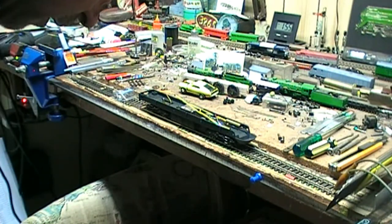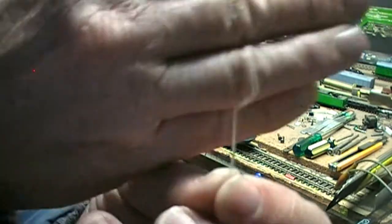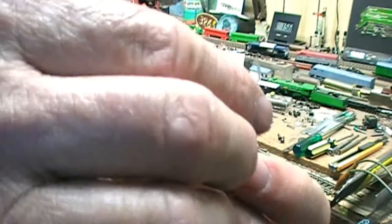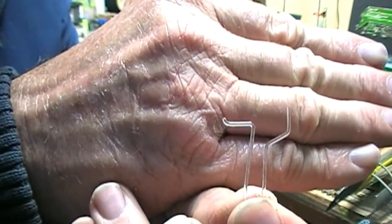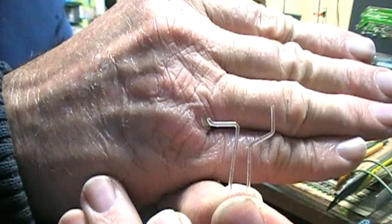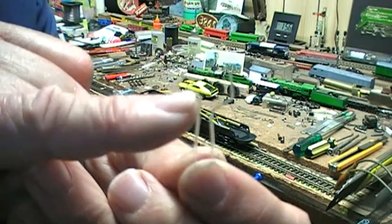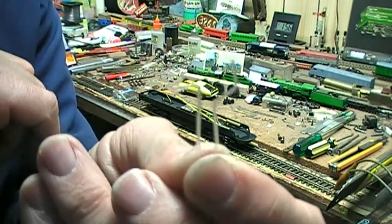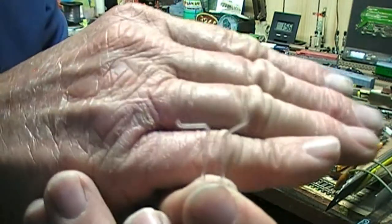Now to try to illustrate or explain, that's another fibre optic that's been done previously, and to get these bends, this one here snapped, otherwise it would have been a pair of these. When you do this, you've got to get spot on. Unless you've got room to play or room to move, it is not easy. So to give you some idea where this and this has been bent, or there and there has been bent, it now becomes brittle, because you change the molecular structure of the fibre optics and it's less flexible than it once was.